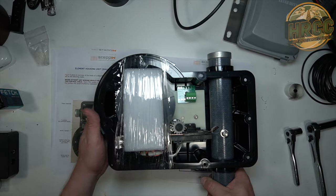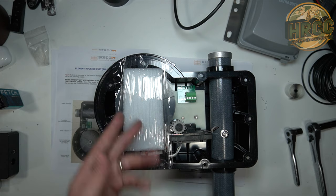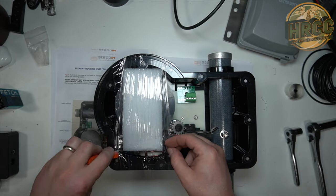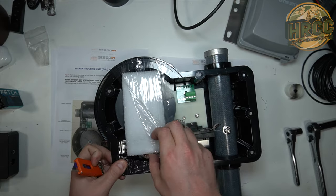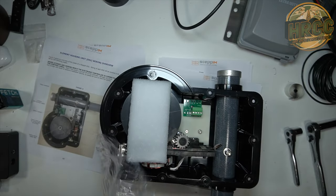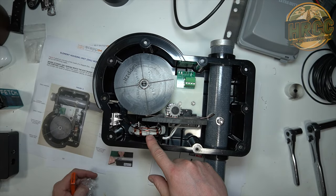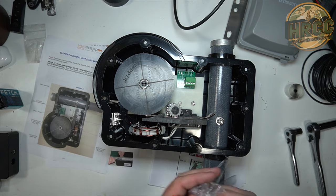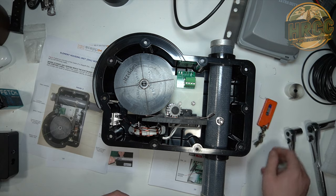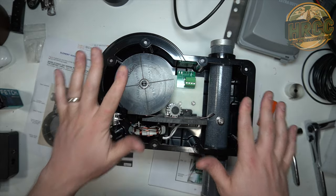This is the EHU as it comes out of the box. It has a bit of plastic to protect it during shipping — you don't want that spool coming loose. This is the driven element of the EHU, and you can tell it's the driven element because it has a balun and a coax feed on the side. All the other elements adjust as needed for the frequency you're going to be operating on, but only the one connected to the coax is actually putting out the power.